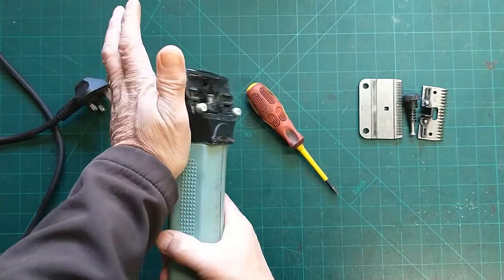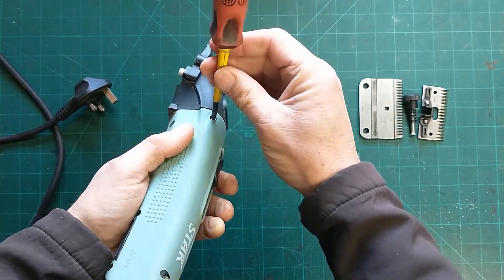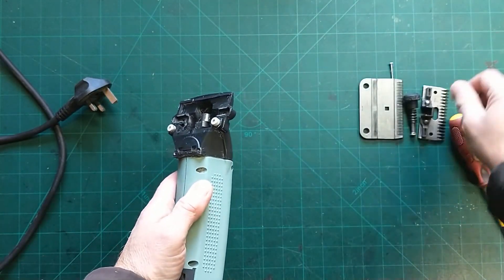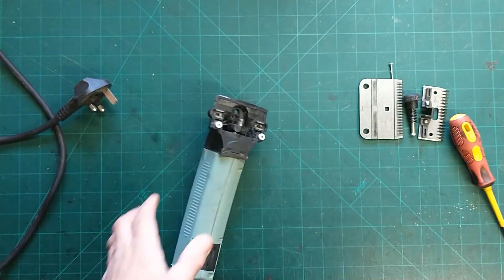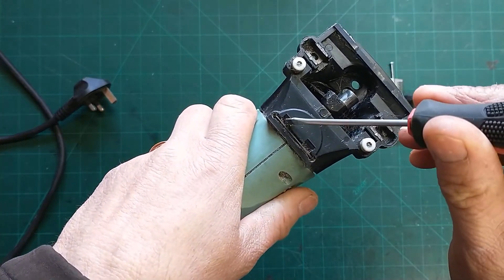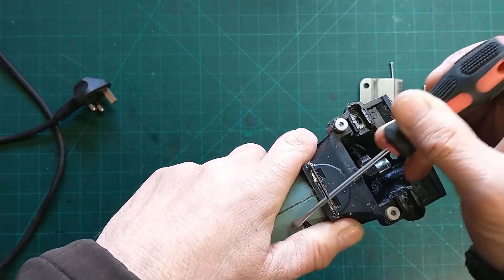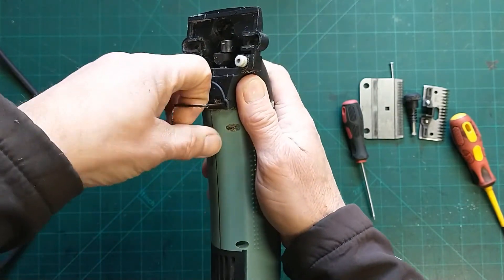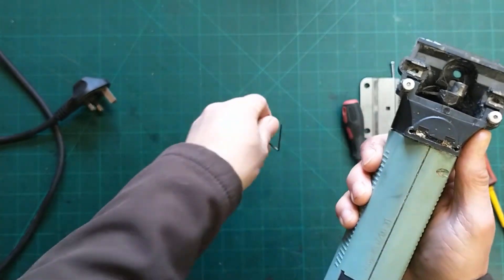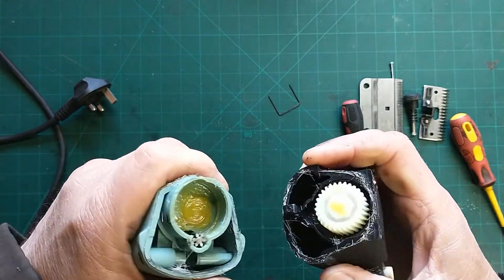One of the hardest bits with these is the screw sits just inside — not enough to come out. It's free, just not quite enough. There it goes. This one here has got a little pin at the bottom. We just need another little screwdriver — under this part here there's a little bit, so we just lever that up, a little bit at a time. Once you get it so far up, you can start to pull it a bit more. That little clip just wedges against a couple of parts inside, and now the head should just push off the front. There it is.